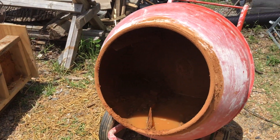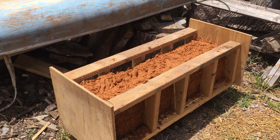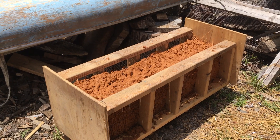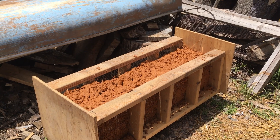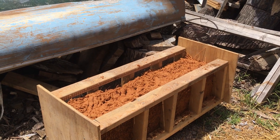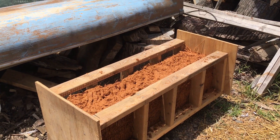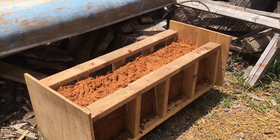The plan is to make the cob in the cement mixer and shovel it in. You can do about 16 inches of cob a day, let it dry for a couple of days, add new forms on top, and keep going — as shown in the last video. This is as opposed to the solid walls used previously.